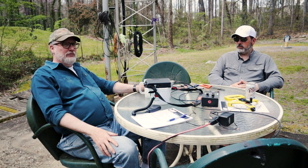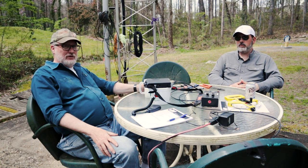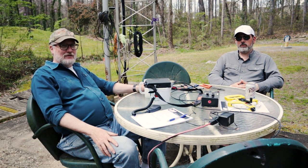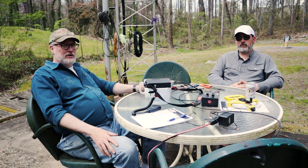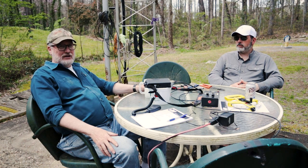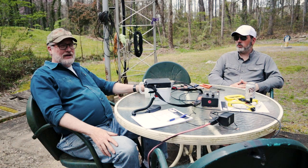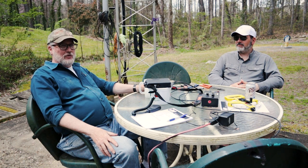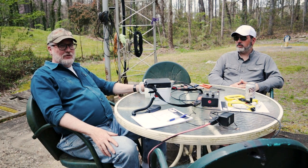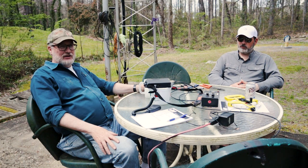And I'll be honest with you, the performance is generally going to be better than that commercially made G5RV that you might be thinking about buying. And there are a lot of reasons for that. Certainly the most important one is that the G5RV does not offer a good match on any amateur band. And if you know anything about coax, when you have a high SWR, losses in coax increase. When you're using coax as a feed line, you really want to keep the SWR under 3. And how do you do that? You use an antenna like the ZS6BKW.